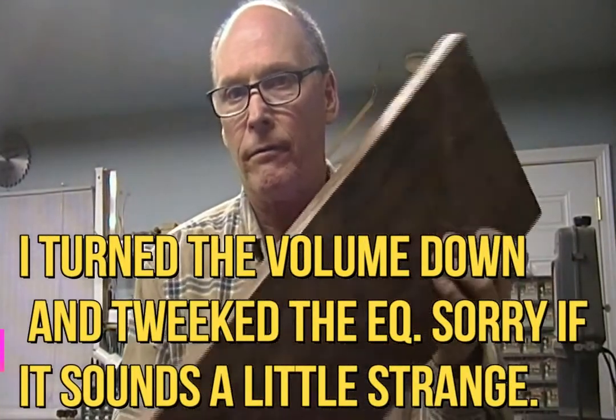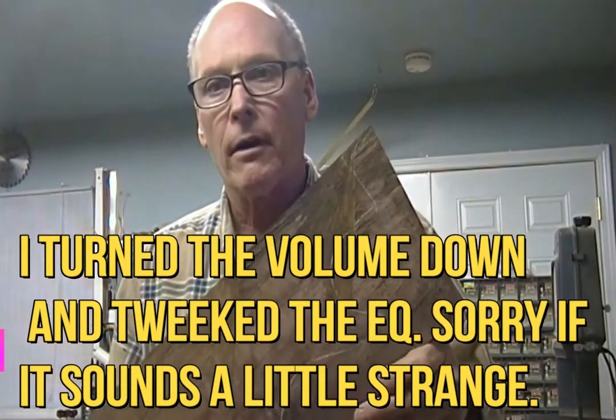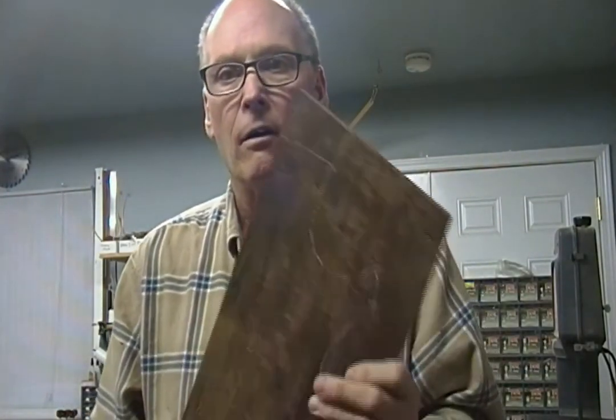Hello, I know there's a lot of background noise. Not sure how well you can hear me. I'm probably going to try to fast forward through a lot of what I'm going to show you here. This is that block of walnut talked about in the last video. I did decide to go ahead and cut it down. I had to rip it down about 7 1/4 in order to get it through the bandsaw, because I don't have a huge bandsaw, likewise to do a resaw on this.